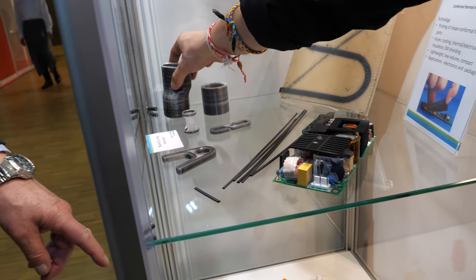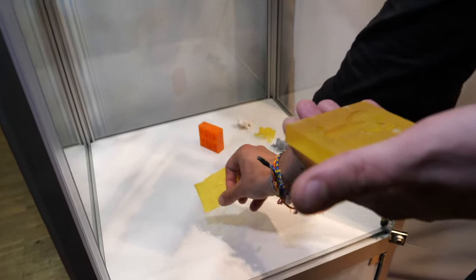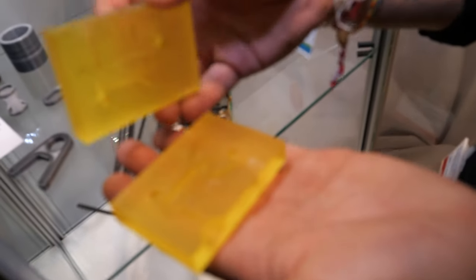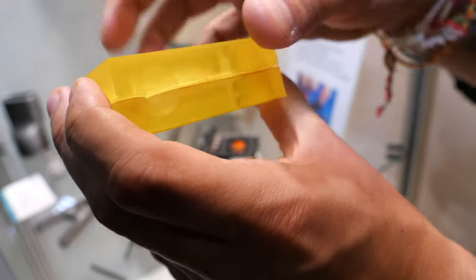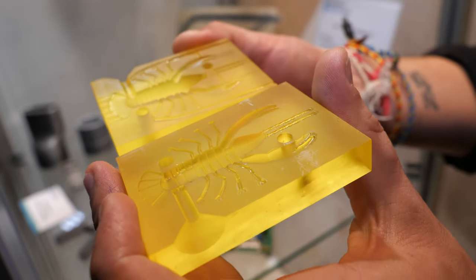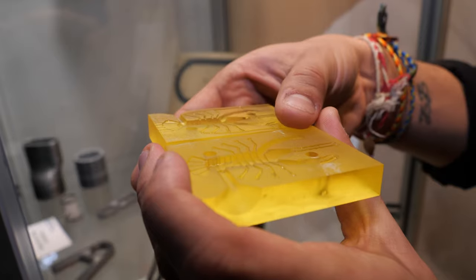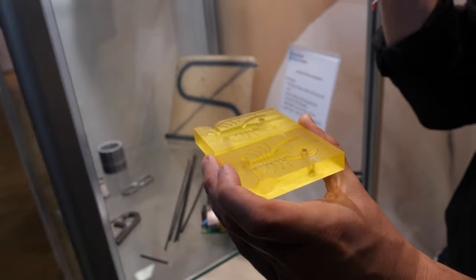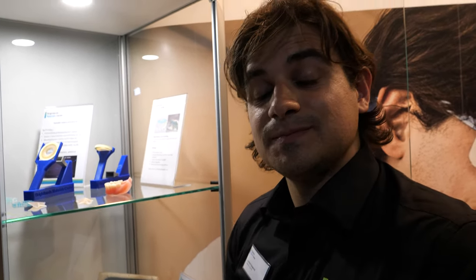And the bottom here? With photo-curable resins we can, for example, make molds — very complex molds that we can close, inject our material into, and then the part takes the shape — for example, of this lobster. It's just a simple example, but AM is very powerful in making really complex shapes that can be used on a very frequent cycle, though not necessarily for a long time.